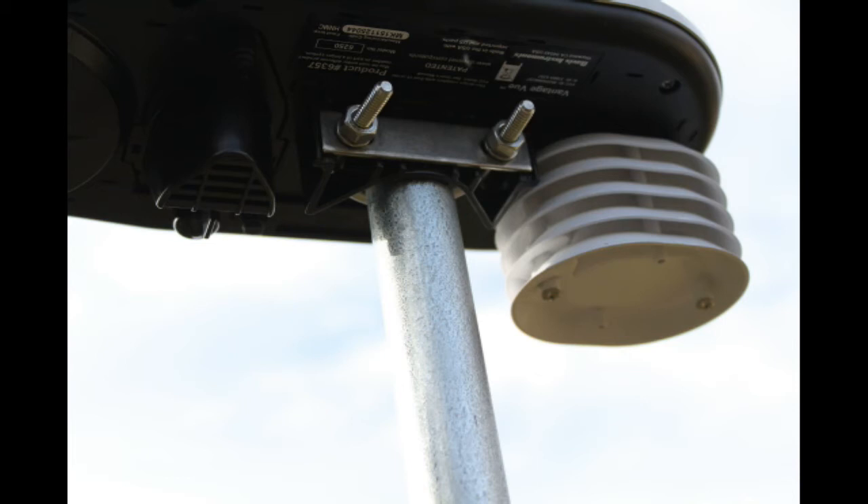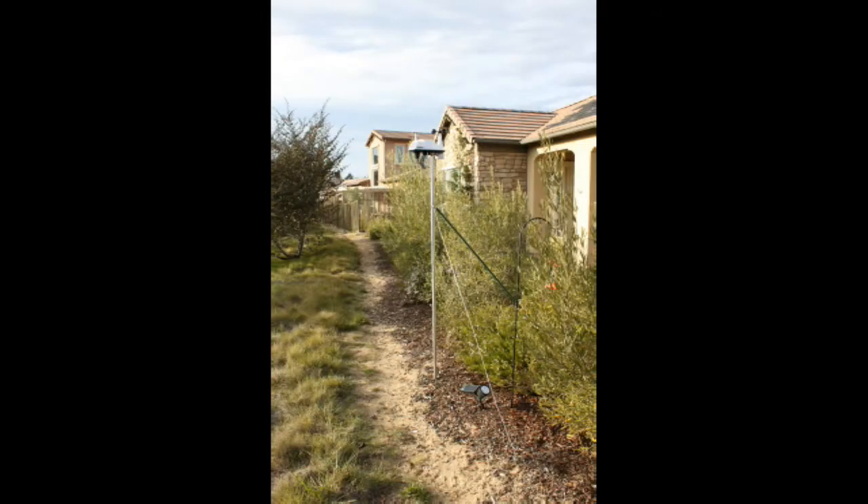Included is a pipe clamp, and you have to purchase your own pipe. I purchased a galvanized one-inch conduit about eight feet long, then drove two feet of it into the ground for support. Unfortunately, my best location was right on the edge of my property line, and that did cause some problems. Because of the length of that skinny pipe, it needs to be supported against the wind pushing it sideways.